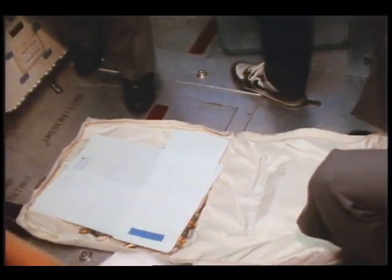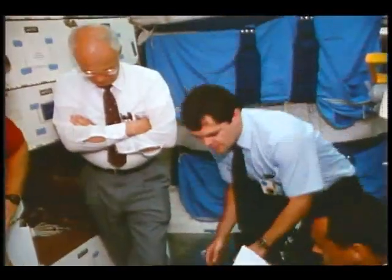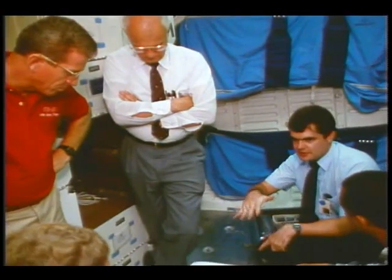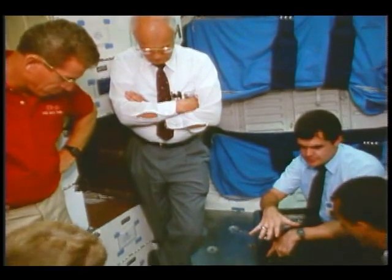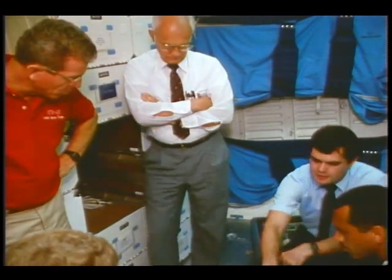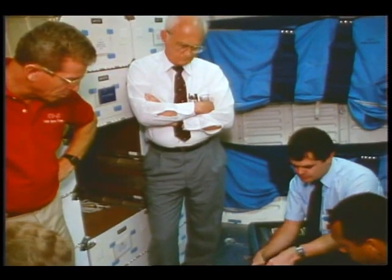First thing you'll see are the big old sheets of Teflon, which everyone calls cookie sheets, but their real name is cold plate protective covers. We use those whenever we do any black box change outs. You can slide it between the black box and a cold plate so that when you're pulling it out, you don't ding the cold plate. We also use them to tape over wire trays so that when you're pulling out a black box, you're not chafing the wire, so slide along this instead. So, we use them for two purposes.